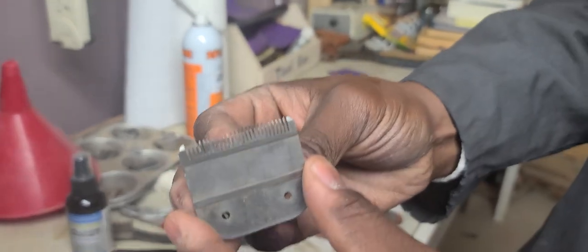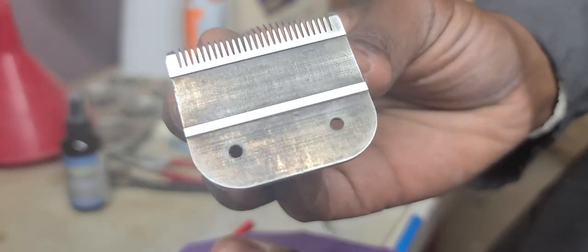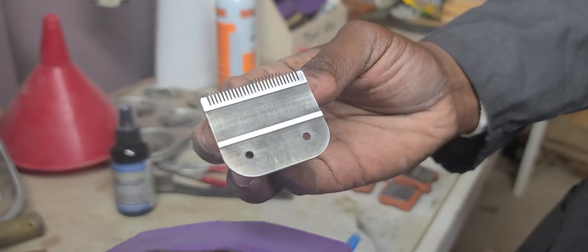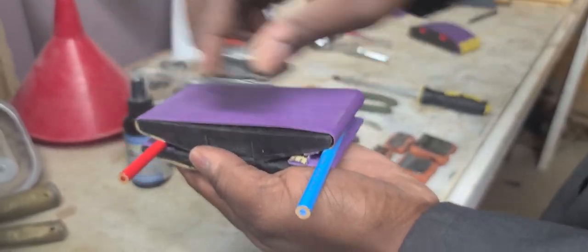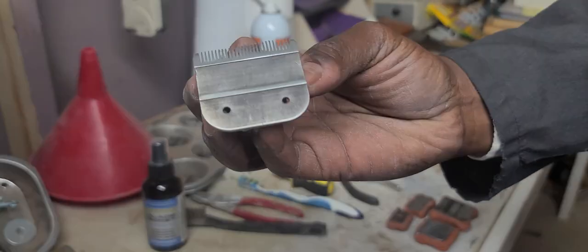Now, let's take a look at the sharpening part. Can you see how it gradually worked its way up? That's what the hollow ground sharpening does for you. One more time. Now, once you get it fully sharp and the shine is all the way across, you flip it over to the flat side. About 2 pounds of pressure, you just flat buff it. Softly, not as much, real light and soft, and that brings everything together for you.